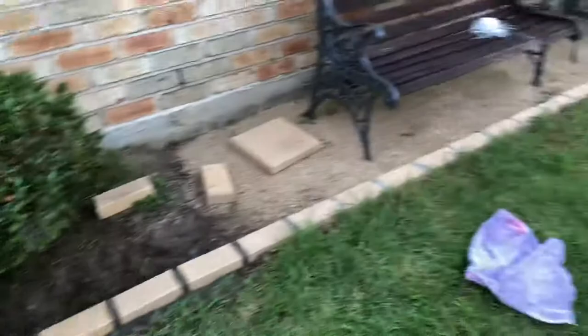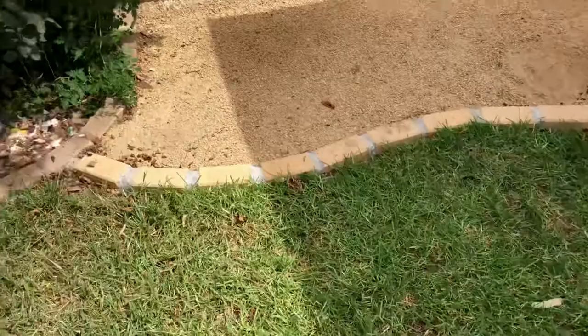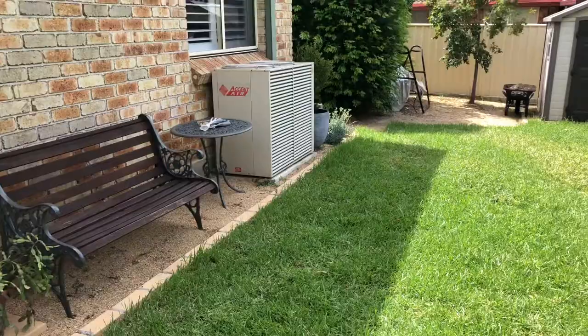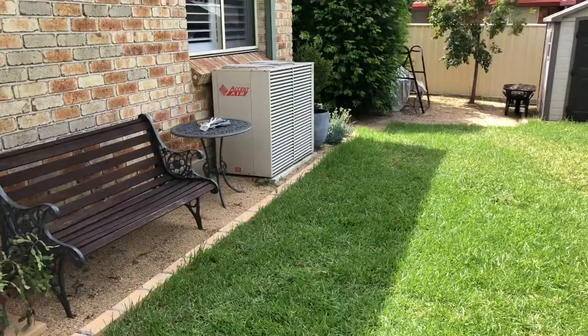That's the old edging there, and there's the new edging we just did — I did all of this in one go, which is quite good for me, but I wouldn't suggest you try to do that much in one go. Usually just do a run of five or six pavers. This is what it looks like today, a couple of weeks later — nice flow into the rest of it, with nice little sitting areas and granite where I've removed the grass. Thanks for watching — I hope it was helpful, and if you have any questions please send them through on the channel.